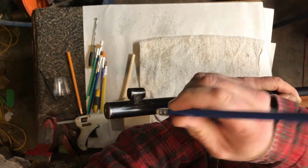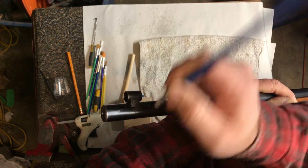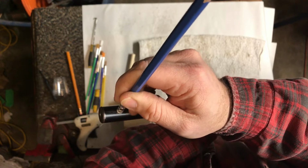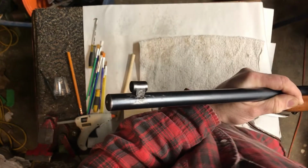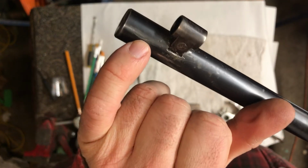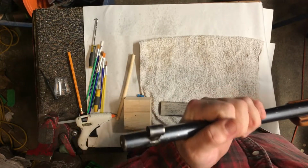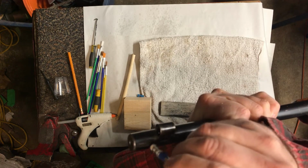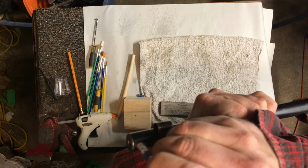And then you can check in. I can see, you guys probably couldn't, but I can see there's a change in the grit. You just work it a couple of times. I'll go up and I'll hit this one. This one's the worst because it's a really nasty scratch. Okay, I don't know if you can see that there, but can you see the contrast around the scratch where instead of being blue, there's a gray area? That's what you're after. And then you progressively use less and less pressure. We're just trying to take off some of the harshness of that scratch.